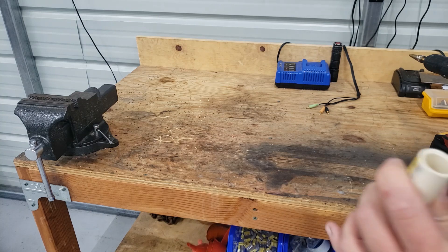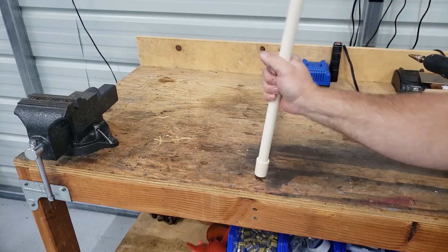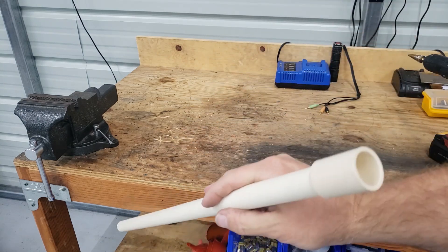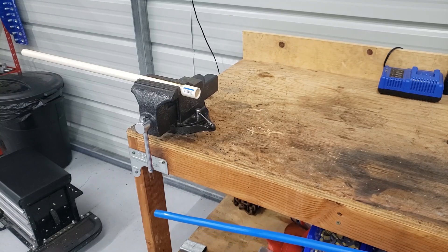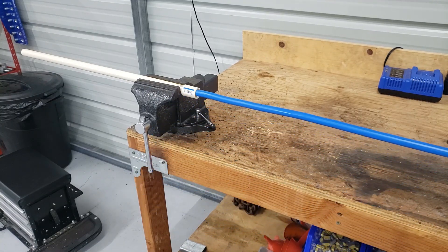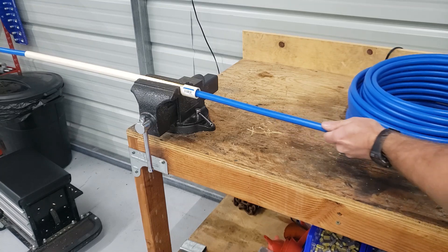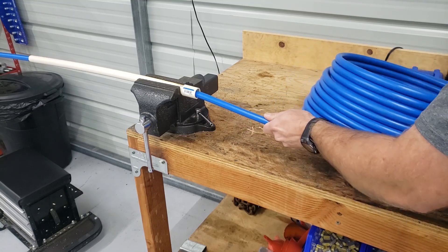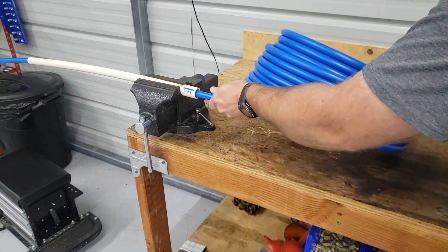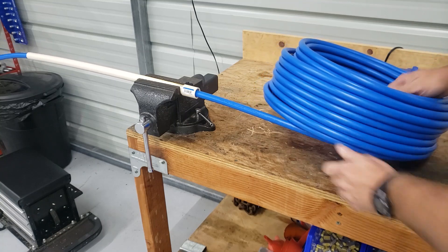And next, just as an added precaution, I bought an end cap for it. We'll just go ahead and put that on there — that will help feed the hose into the tube that we made. Now, what we're going to do is take our tubing and feed it into our straightener from the spool. It comes out pretty straight at the end. You can do a lot of this at one time, or you can straighten it a little as you go as you install the air line.